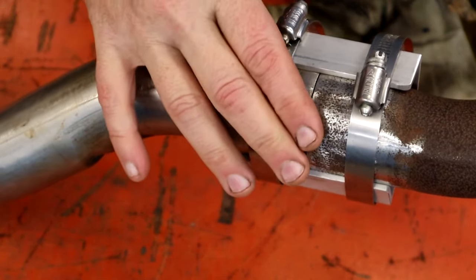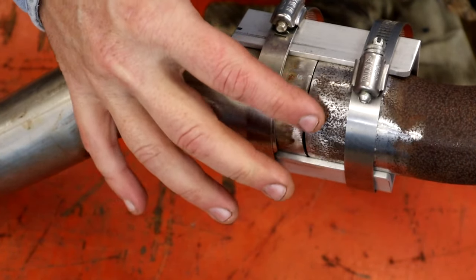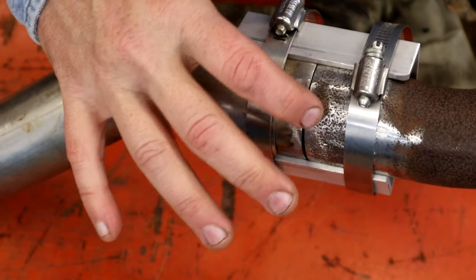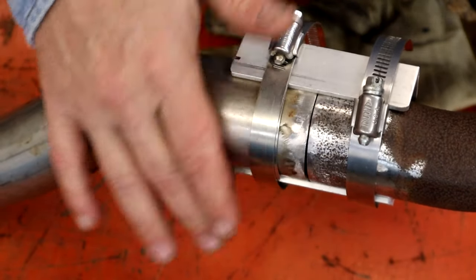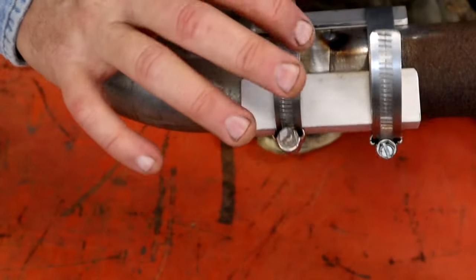And to make your best looking welds, we may come back and knock the heads of those tacks off. So when you run over it, a lot of times it'll make a jump, like a bump over top of it. So we'll get it tacked in about four places here and top both sides, and then we'll come back and just knock the heads off of that. Then we'll weld in quarters. It's what you want to do if you can.